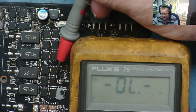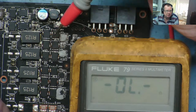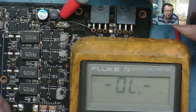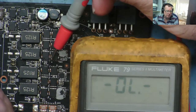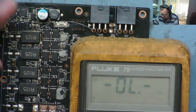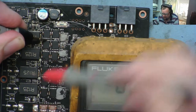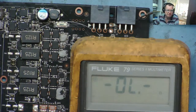So we have a high side and two low sides — the high side is upside down — and these are the two low sides. Each set of three: one high, two low will drive one coil. High-low-low drives this coil, high-low-low drives this coil, and so on for all four phases. What you'll notice is the 12 volts coming in here doesn't connect to these two — these are connected together because they actually go to the other 12 volt connector. So we've got two phases running from one connector and two phases from the other.